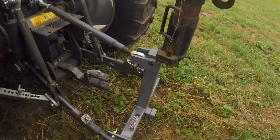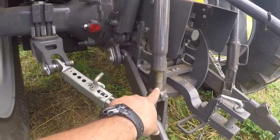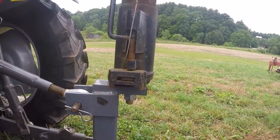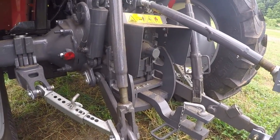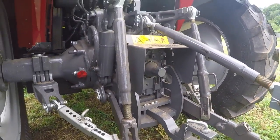One thing we did do yesterday — this tractor was basically brand new. We adjusted these link arm lengths a little bit longer. The lift arms would only go down to about two feet off the ground and I couldn't get the trailer unhooked even with the jack down. So we lengthened those, but that's normal — they come screwed all the way in from the factory on all tractors.